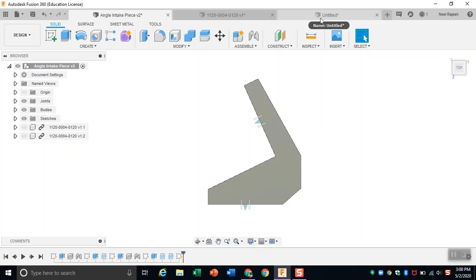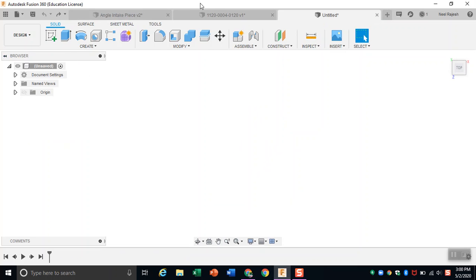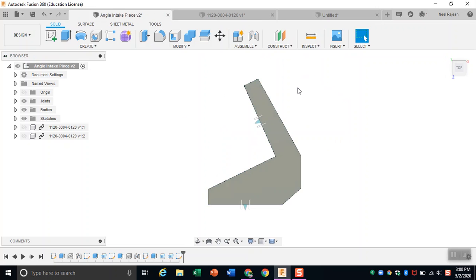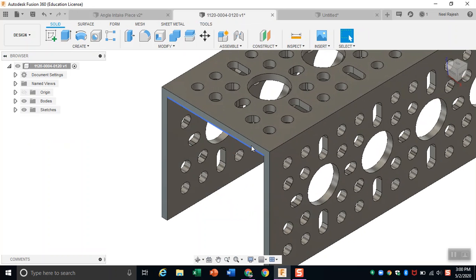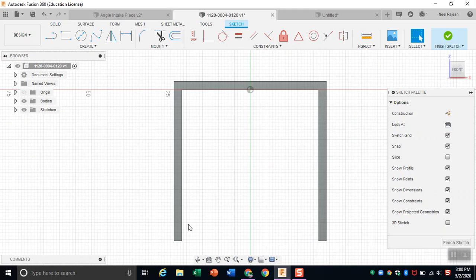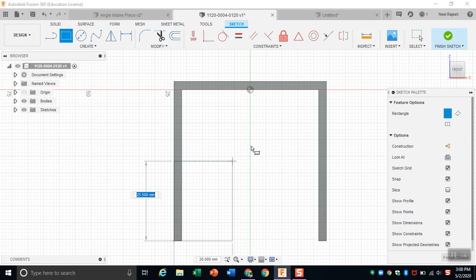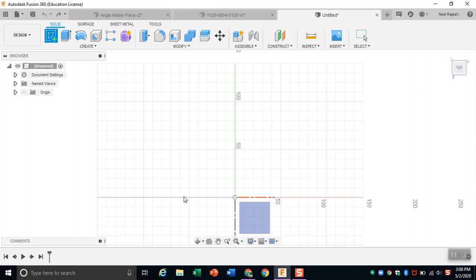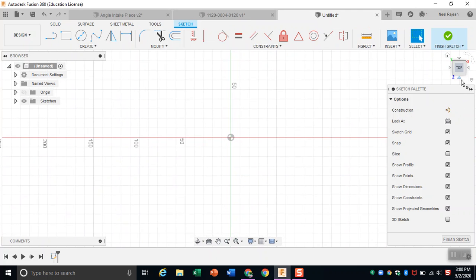In order to start, we need to find out the dimensions of the channel that we're going to be using to put inside here. Just create a rectangle, then find the measurements of the rectangle of the channel. Make sure you measure the outside, not the inside, because we're putting our piece on the inside. As you can see, our channel is 48 millimeters by 48 millimeters, and that's what is going to be the inside of our piece. So in order to start, we need to create the angle part first.